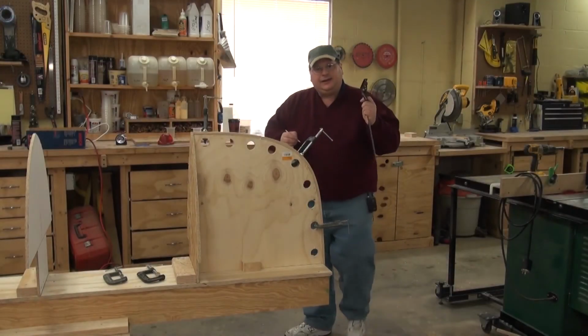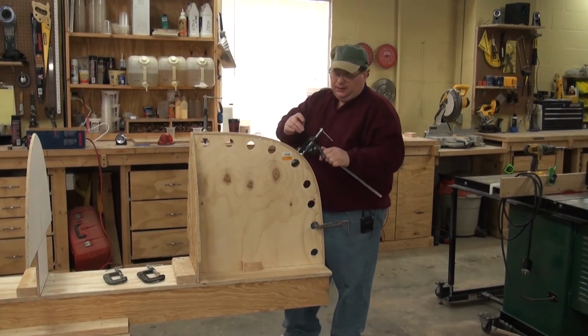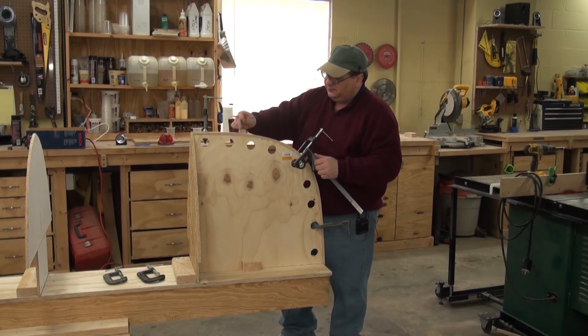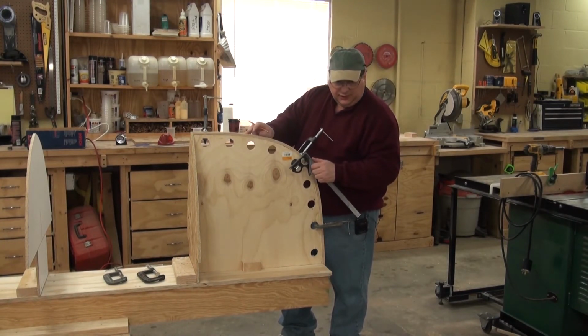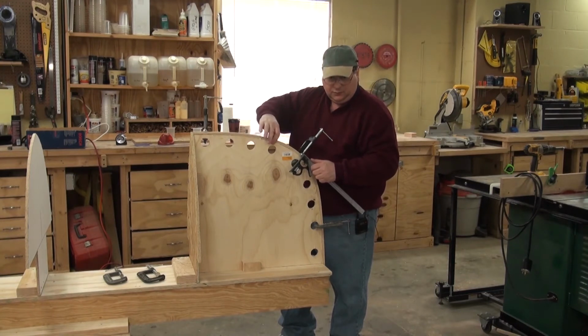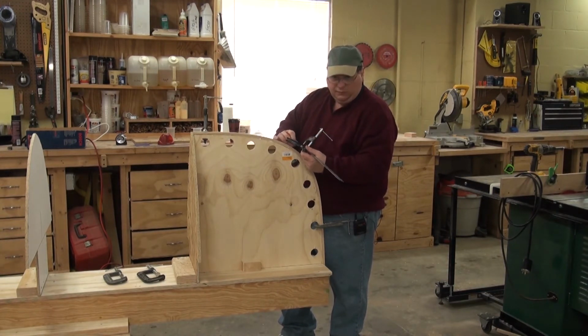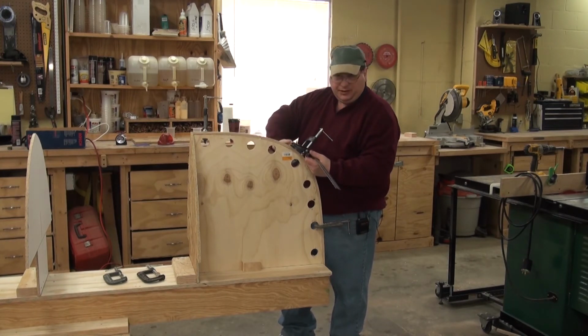All right, what I have in my hands now is just a simple carpenter square. I've got it set for a quarter inch here, and the reason is I'm about to divide this stem into three sections of a quarter, quarter, quarter. It's three-quarter inch thick. What that does is it gives me lines that I can watch as I'm shaping it. I don't want to go past that because I'm going to want a flat spot all the way down